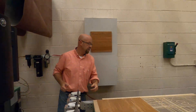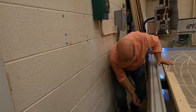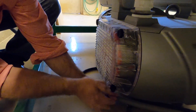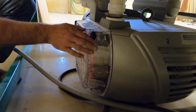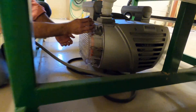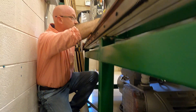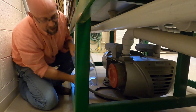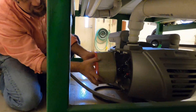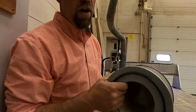Next I want to talk about the vacuum system. The vacuum pump is underneath here. I have to remove these four hand screws. This doesn't have to be done that often — I'd say once a week given the amount of use we get on the CNC here. This is not a production shop where it would have to be done on a daily basis. When I take those off, I lift the cap off, and to get the air cleaner out I gently slide it out. It's a little tight in here, which is why the machine is off.